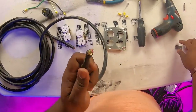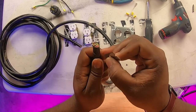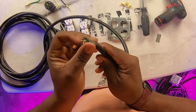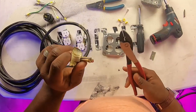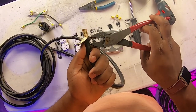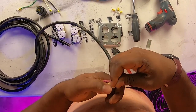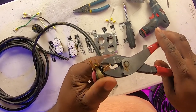Let's take our standard cable. I'm going to splice this open to expose the wire inside. I'll take my razor blade and be extra careful — you don't have to cut too deep, but a little scoring will start to open it up. We're going to expose the wire underneath and get rid of the excess. Most crimpers have a cutting end, so we'll use that to start cutting the rubber jacket off. This cable also has a paper/cardboard-style insulation — we're going to cut all that off as well.